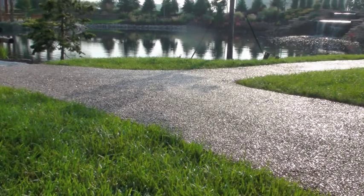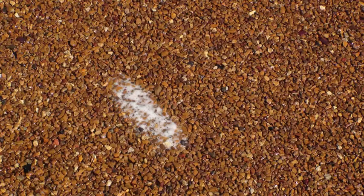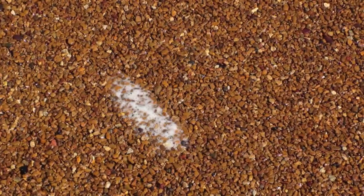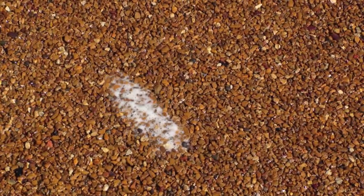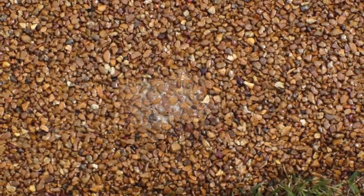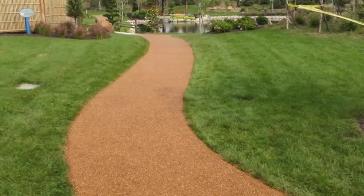Occasionally, if you apply too much gravel lock on the roll coats, you get what's called foaming. That's where gravel lock drips off the roller, puddles under the surface, and after a while causes a chemical reaction — too much liquid in one spot starts to cure from inside and bubbles. This is easy to fix: just remove the affected areas, mix up some gravel with gravel lock, and patch the spot.